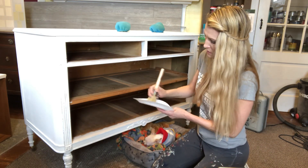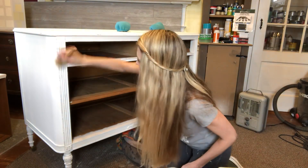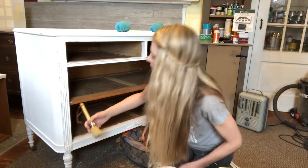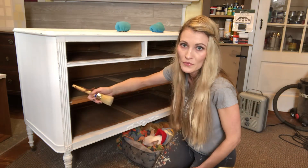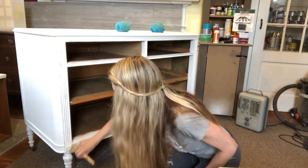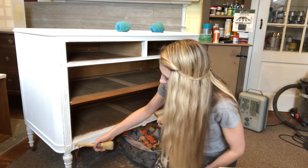I'm working the wax into my brush and going around the frame. Here's another helpful hint: on this dresser I have some grooves, and you don't want to load too much wax near them — it gets caught in the grooves and is a pain to get out. The less wax on your brush, the better when going around grooved or ornate parts. I can already see the wax has darkened that pretty ornate flower at the bottom.